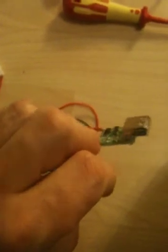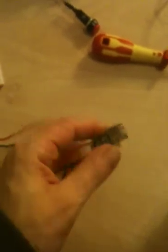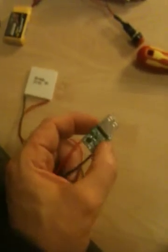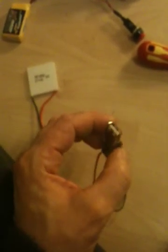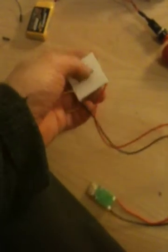And all I've done is, I said normally these are used with lithium-ion cells, but what I've done is I've attached it and soldered it directly to the TEG element, okay, to create this lovely little generator, little step-up thing, which we can charge capacitors and all sorts of USB type stuff, possibly even things like mobile phones. And it's so damn simple. And, you know, that costs £1, no, actually less. I think I got this for 80 pence from AliExpress. I got 10 of them. And these cost about £2.50 from another specialist place from Hong Kong.